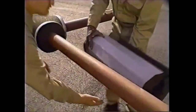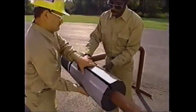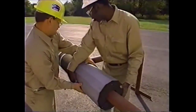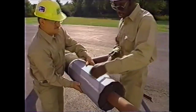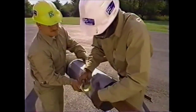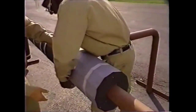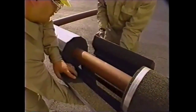Install the Advantage wrap-around section on top of the pipe and wrap the bottom of this section into place. Inspect for fit and closure of the joints. Wrap a band of reinforced glass tape six inches from the end of the section, remembering to overlap the tape 50 percent. Wrap a second band of tape six inches from the other end. For larger diameter pipes, metal bands will be required to assure closure of all joints. Repeat these procedures on the following sections.